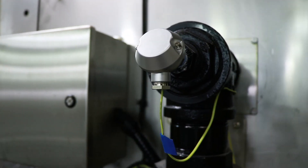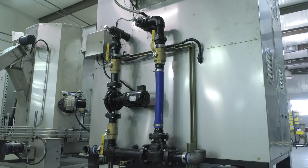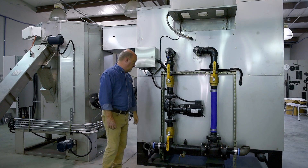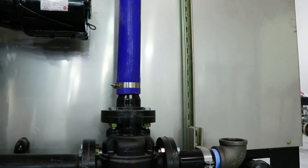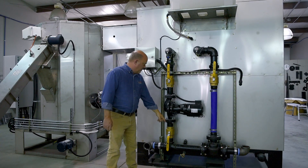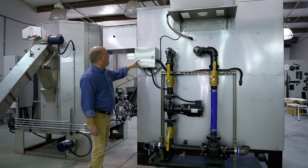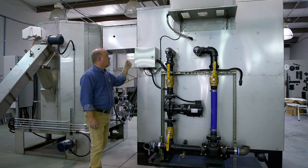We have the ability to measure both the hot and cold water temperatures for flow and BTU measurement. Three-inch plumbing allows for the 100 GPM that you need for good thermal transfer. There's a protection valve here that we use to protect the machine from condensate. We have clean-out ports — one in the back for the cyclone and two more down here for the actual heat exchange tubes. Then we have the drain and/or fill tube, and just the wiring junction box between the combustion chamber and here.